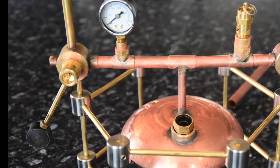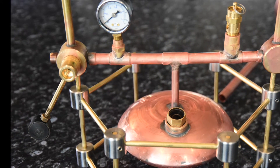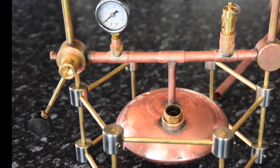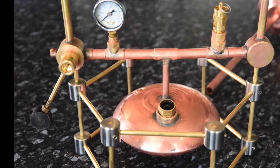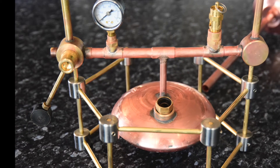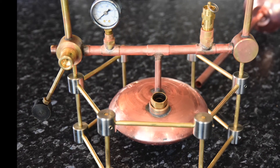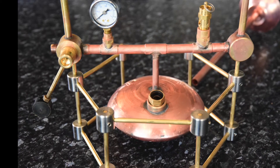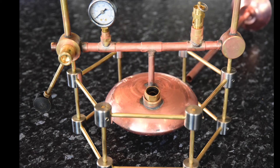When doing this kind of testing it's a good idea to fill the tank with water first and then just add a little bit of compressed air to give the pressure you want. That way if it ruptures and bursts there's not a lot of expansion, because water is non-compressible, and if it were to burst it would just pop open without causing a major explosion — whereas air inside under high pressure could blow it wide apart and throw bits of metal at you.